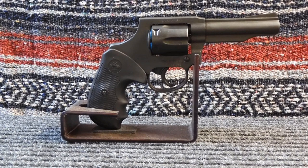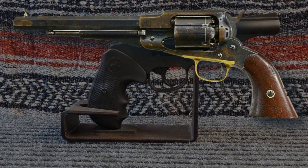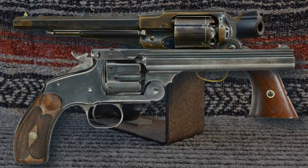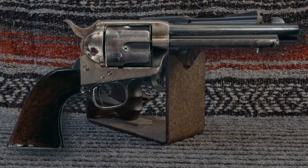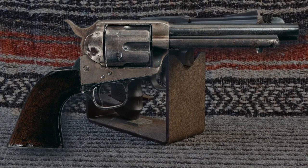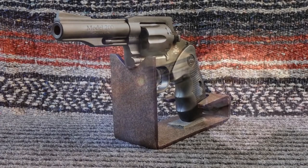Brass-framed revolvers were more prone to shooting out than steel-frame revolvers, which, incidentally, made the Remington and Smith & Wesson revolvers favored over Colt revolvers. That is, until 1873, when Colt introduced the Colt single-action revolver that we know today. Another aspect of the cylinder gap is loss of velocity due to the gap. Although nobody that I am aware of can say how much velocity is actually lost due to cylinder gap.